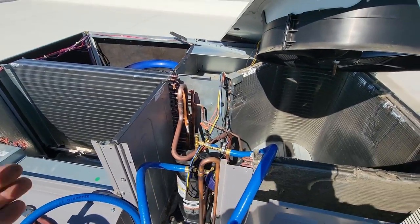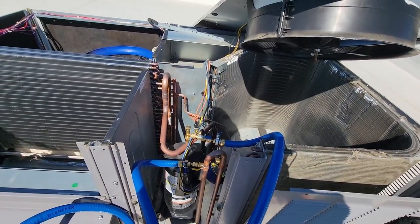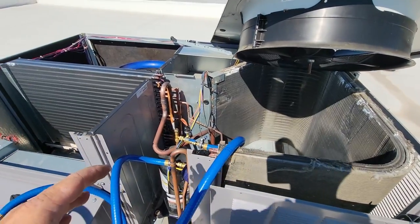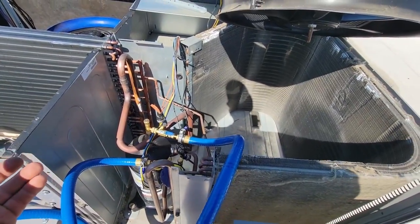We're gonna shoot down to below 500, valve it off, see if it holds. It may rise as high as 1,000. This had some refrigerant in it. This had a nitrogen charge in it, so it was never completely emptied to the atmosphere. It's not gonna take that long to go down. Any extra time it takes to get the microns down is gonna be mainly just refrigerant boiling off and not moisture, which is what destroys the compressor.